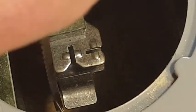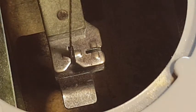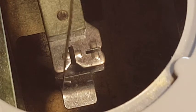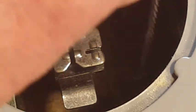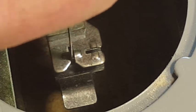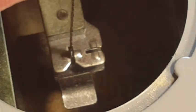With the blade mounted the way most people would use the saw, the cutting teeth face out toward the front of the machine and you push the wood from the front to the back to make the cut. If the blade is on the other side, you'd push the work from right to left, or the opposite if spun around. If the teeth face the back, you'd actually have to pull the work toward the front. So it's pretty versatile — you have four different blade mounting positions.